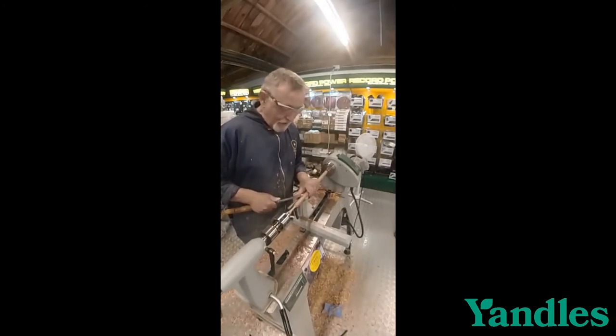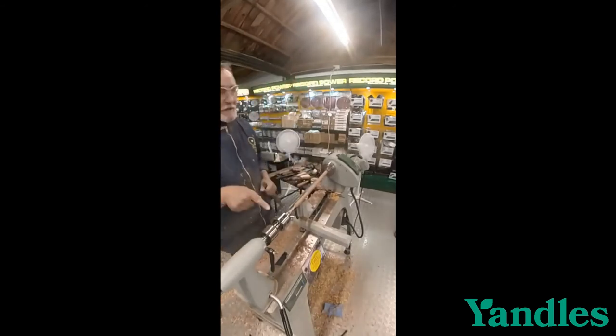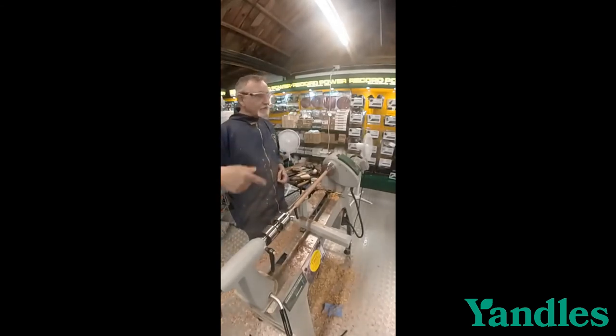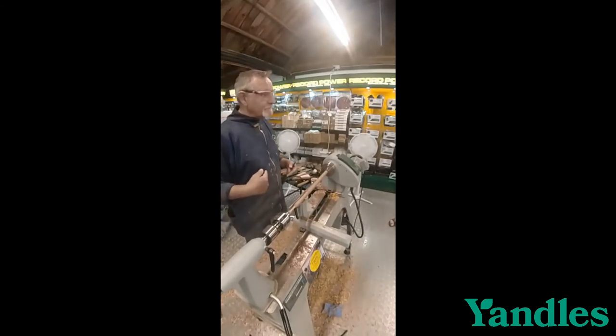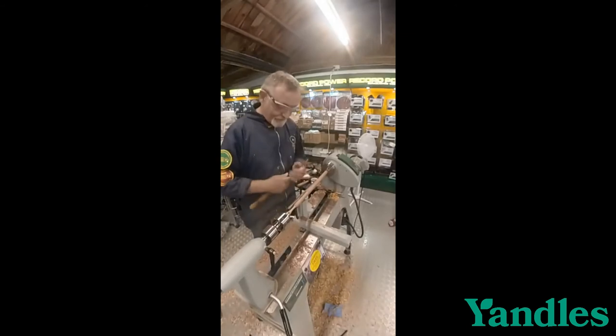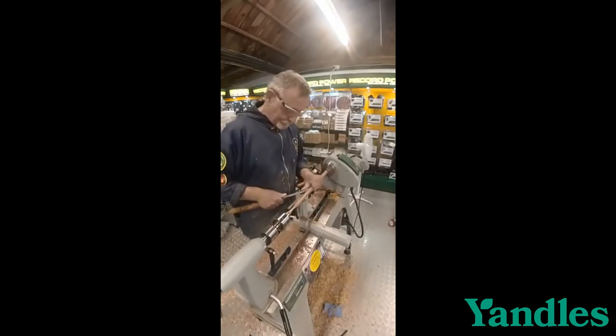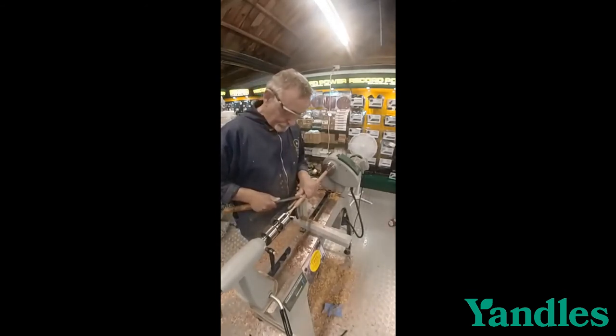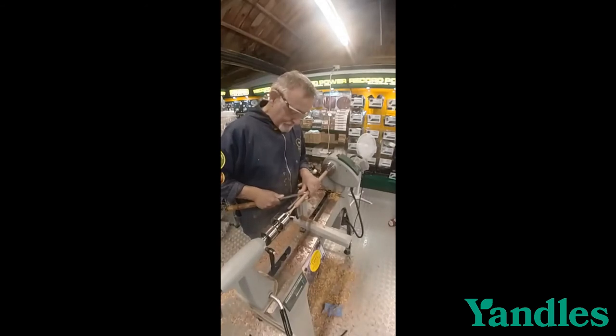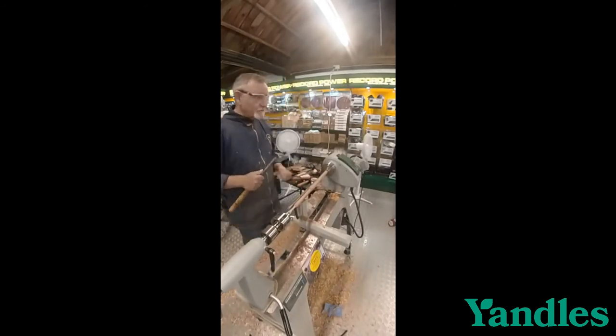I'm surprised there's no question, and I'll tell you what the question I expect is. That screw thread does up as a standard screw thread, but it's rotating the wrong way. Why isn't it coming off? And the answer is because this piece of wood's pushing it back on. Now this depends on my nerves.